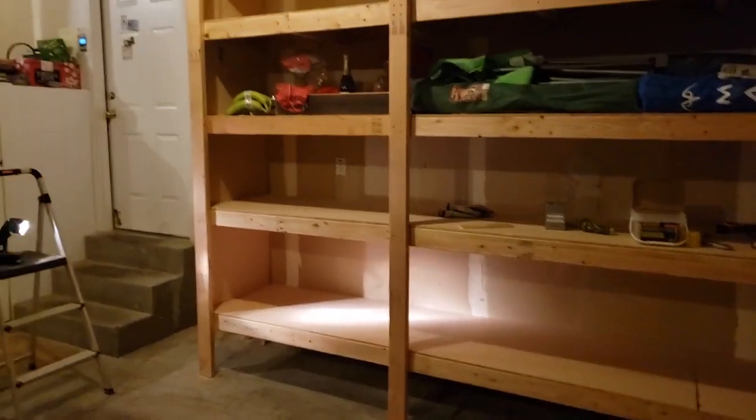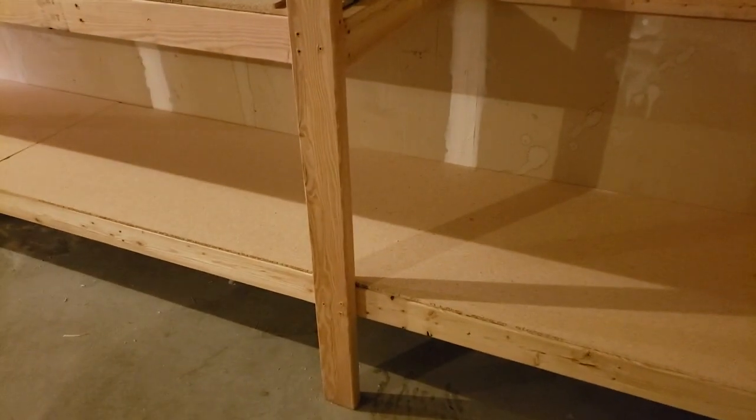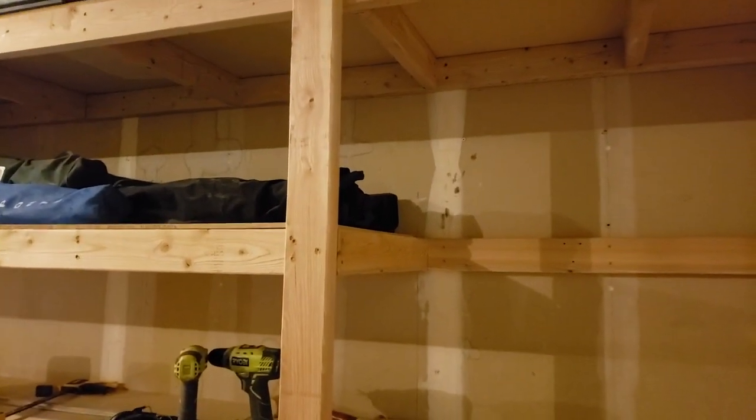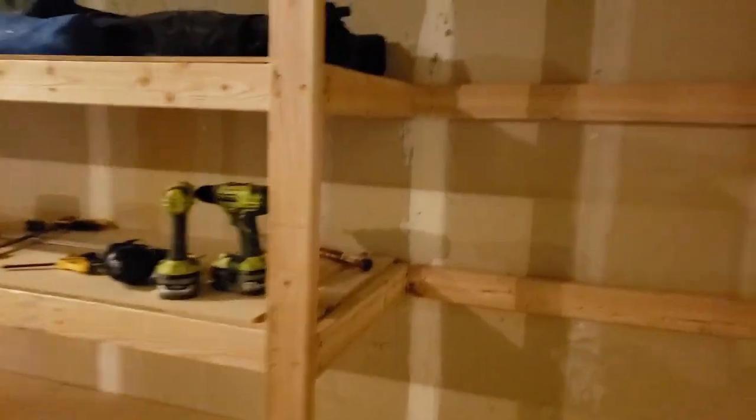All right, I got that center done, I got this done, and I've come over into this closet, and I just put some braces across, just in case somebody down the road wants to put shelves in here. But what I'm going to use them for is to put hooks so I can hang things in here. And I've got the floor, goes all the way across. So I need a nailing surface on the bottom there, and then I need one on the top, right there. And I'm just going to cut a couple of 2x2s and attach those just for nailing surfaces so I can put the closet wall up right there. So let me go make those cuts.